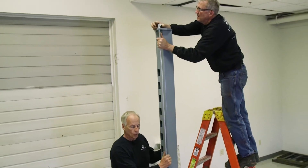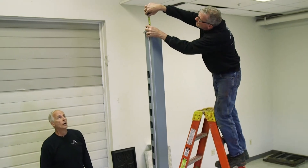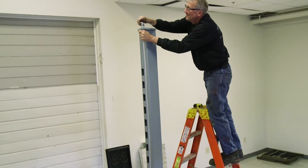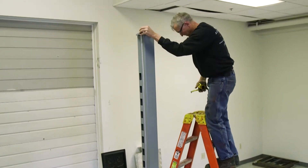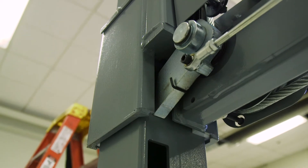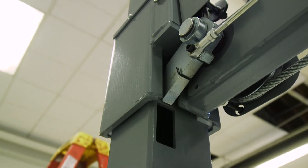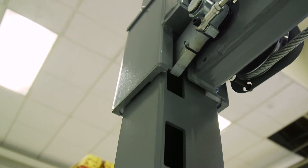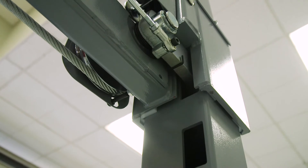We're back to this one — we're going to raise this up 3 quarters of an inch. Now as you notice as the lift is coming up, you're going to hear the locks engage into the hole. We put high tension springs on there so that there is a very powerful kickback into the holes. Now you'll notice that you hear them all firing pretty close together. That's good for right now.